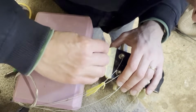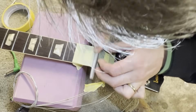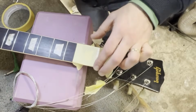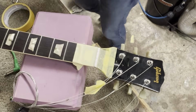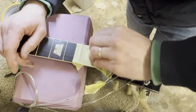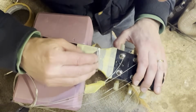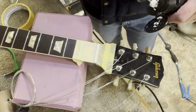Just a medium 3M pad. So we're not taking the lip or the slot off here. We're rounding over the front edge of the nut that doesn't actually touch anything other than your hand, hence wanting to just take that edge off a little bit. So 400 grit now. And once again, just put a little bit of my favourite compound, the Scratch X.